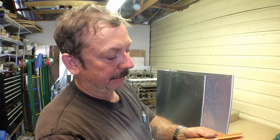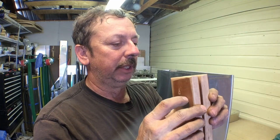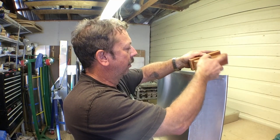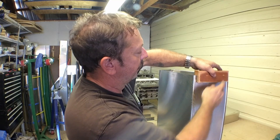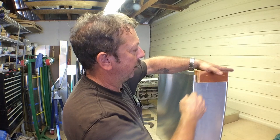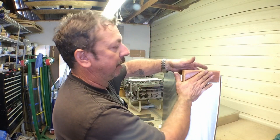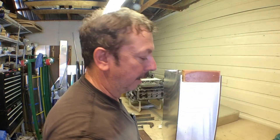In use, they fit together with the piece in between and they just set over the end of the tank. Your guide pins will set the depth, so you just want your guide pins to rest on top of it, and then you just squeeze them together. I use heavy-duty C-clamps, put a piece of steel backing on both sides, and then just tighten them down with a couple of big C-clamps.